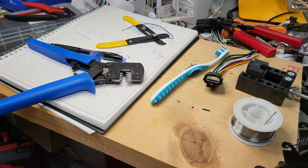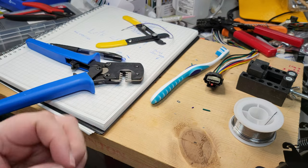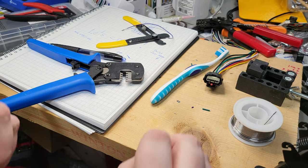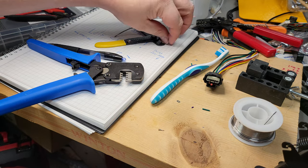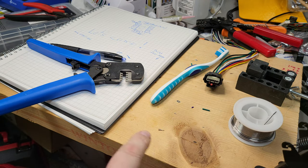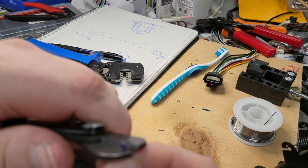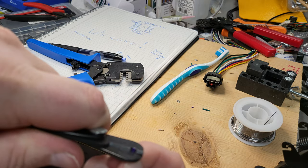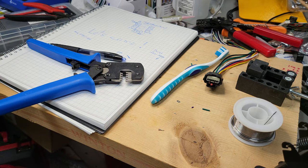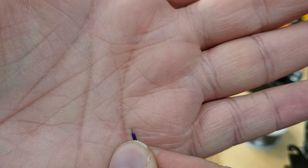So this is what I came up with and it seems to work — it's not perfect, but I'll show you. The first thing you've got to do is strip the wire. In this case, because the terminal is so tiny, you want to only strip a little bit — maybe 1.8 millimeters. That's actually from the spec, so we're talking just a tiny little bit.